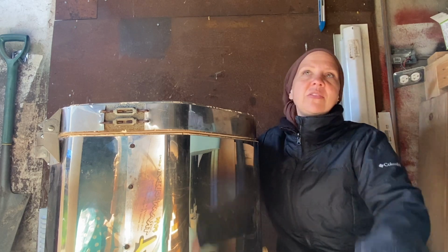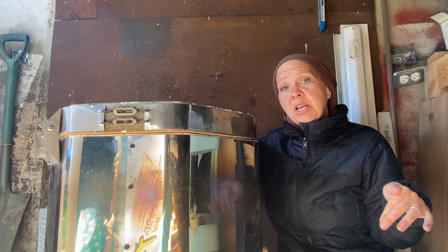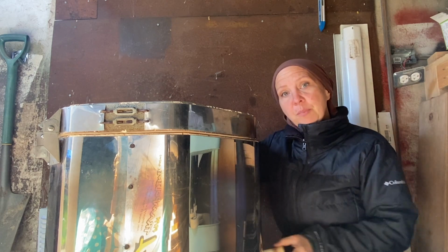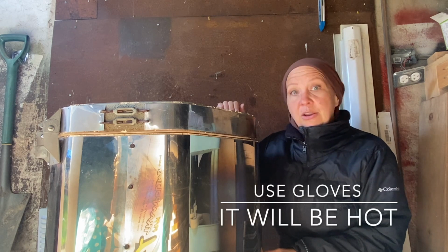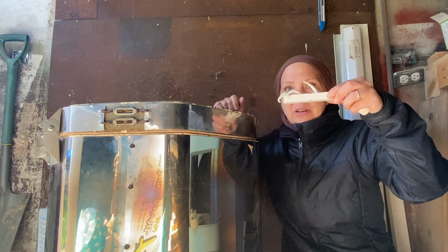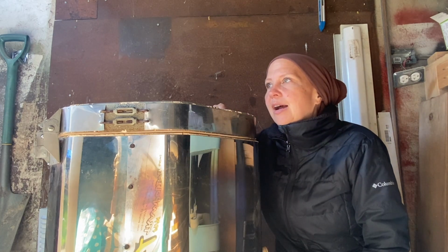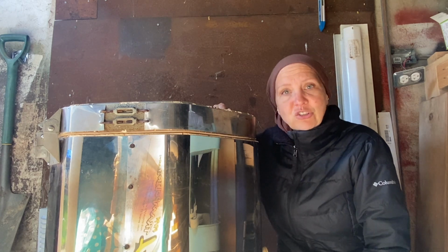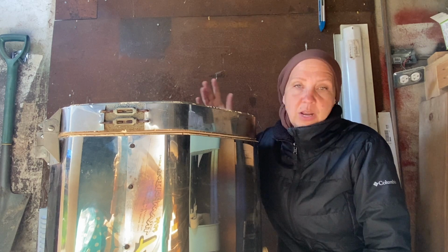So what's going to happen is after you set it to high to fire until it's done, you're going to come out on occasion, remove the bottom plug, and take a look at your cones inside. Now you're waiting to see that target cone be bent to 90 degrees. What I did when I started was I just came out about every hour and checked it just so that I understood how the kiln worked. I don't come out every hour now.